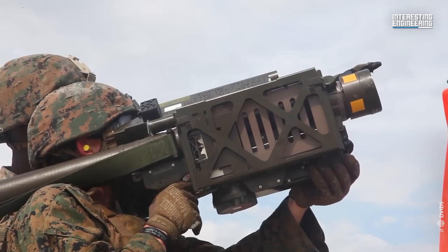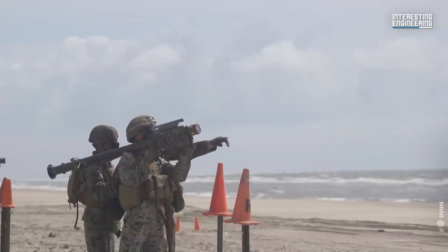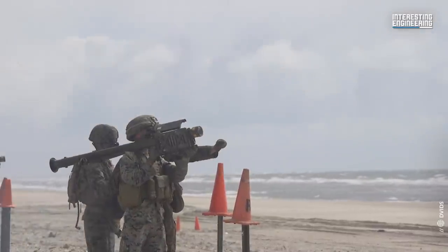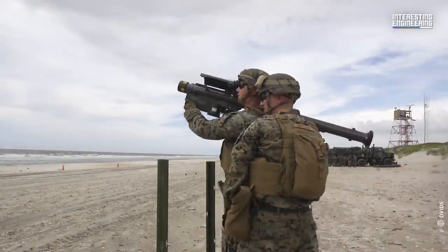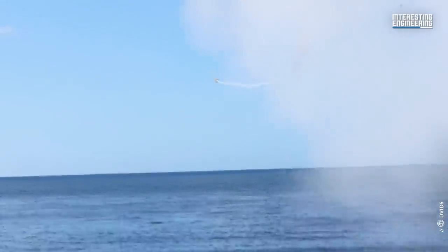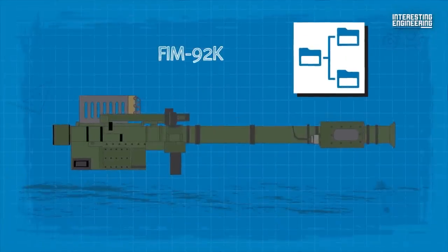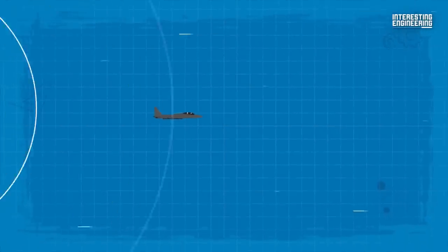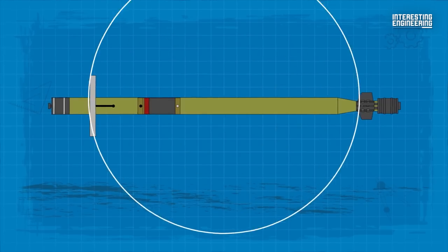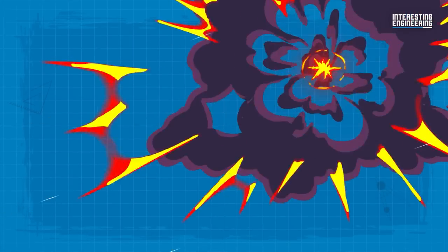Stinger is guided by an infrared passive system. The seeker has the ability to focus on moving as well as stationary targets. There have been upgrades to both the seeker and the computer. The FIM-92B and later models use a seeker that detects both infrared and ultraviolet light. The FIM-92K makes use of a data link to enable a remote sensor to acquire a target outside of the Stinger's sensor acquisition range, allowing the missile to make mid-air adjustments to its course and successfully acquire the target.